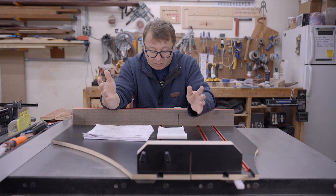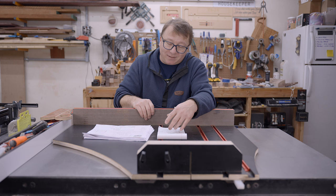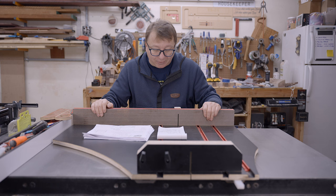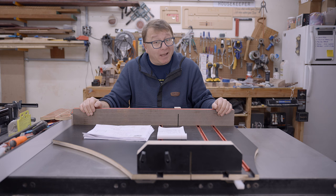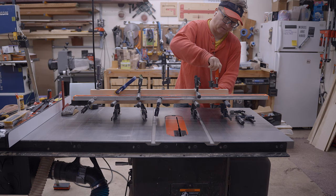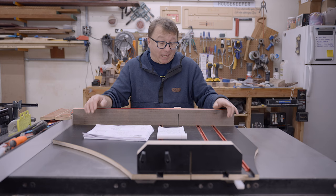There was nothing in the plans indicating what should be laminated and what shouldn't. Had I read the plans more carefully, it would have occurred to me not to laminate that side. I chose to simply plane the laminate off, but I planed it a little too much — now instead of sticking out, it was sunken in. So I remade it again. I laminated it properly, put it all together, and it wasn't flat — because when I glued the boards together, I didn't clamp them to anything. I just trusted the plywood was flat, and I had yet another rear fence that wasn't.